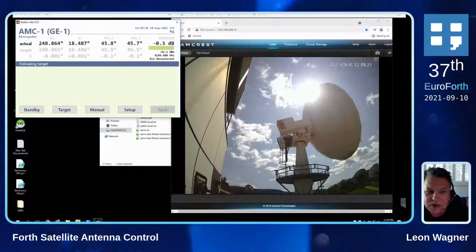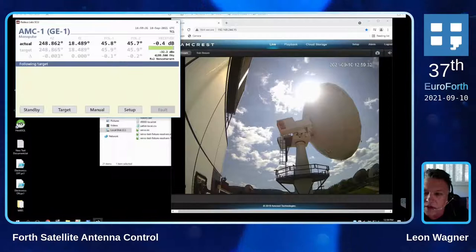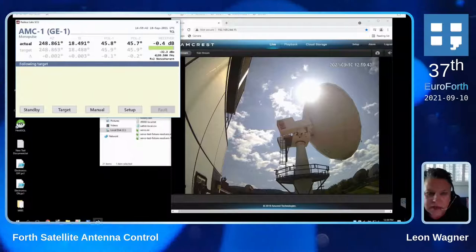I have not only the control panel that I'm accessing, but I have a live feed of a camera pointing at the antenna. This antenna is a 13 or 14 meter antenna. It's a full motion antenna — it can swing all the way over in elevation from one side to the other, and it can swing all the way around almost 360 degrees in azimuth.